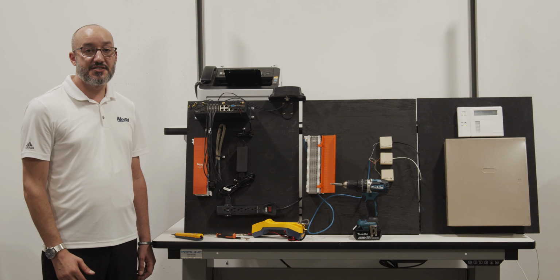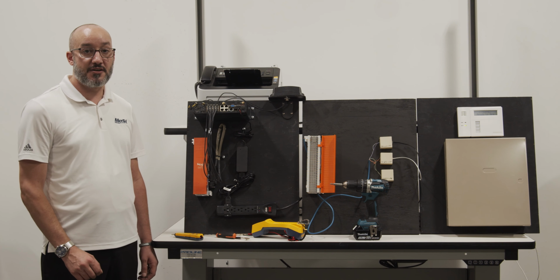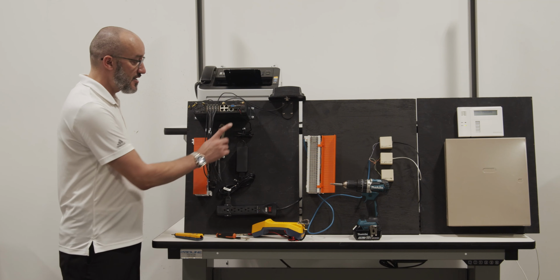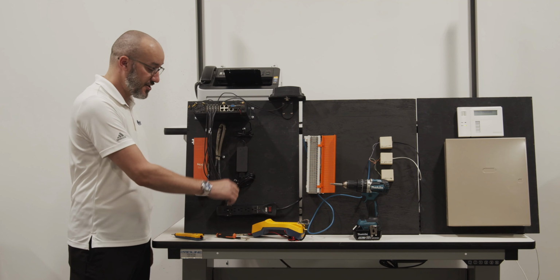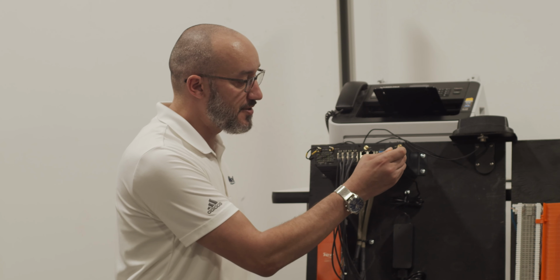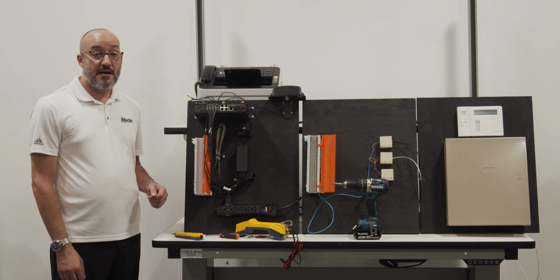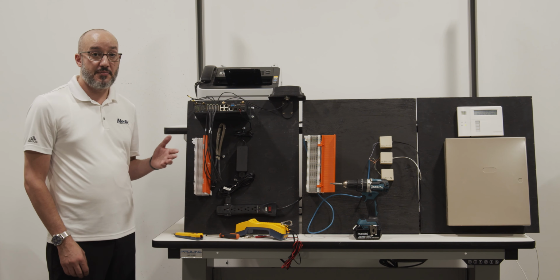Now that we've completed installation of our external antenna, we can go ahead and plug the power strip into the customer power outlet and slide the power switch from the off to the on position. I find that because this switch is a bit recessed, it is easiest to do this with your Phillips head screwdriver. Now that we've applied power and given the device time to boot up, we've got a bunch of LED lights that we need to review.